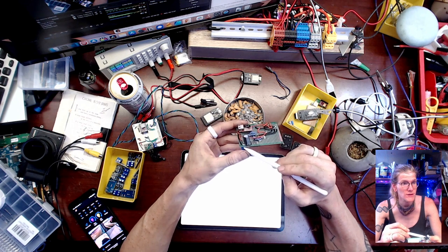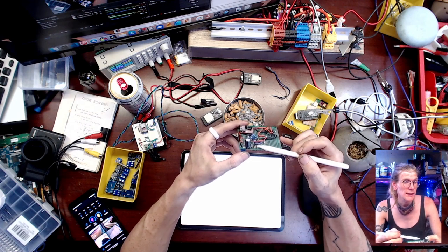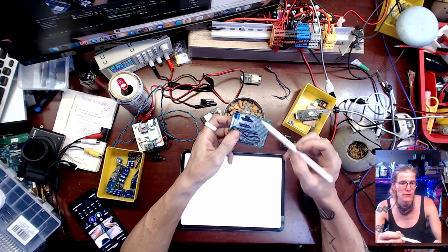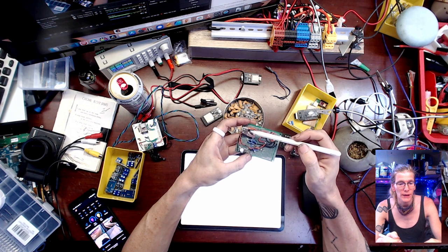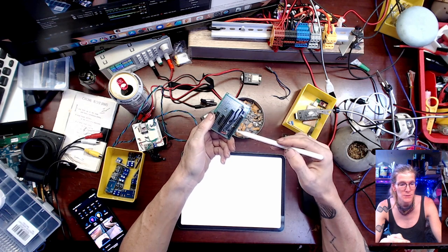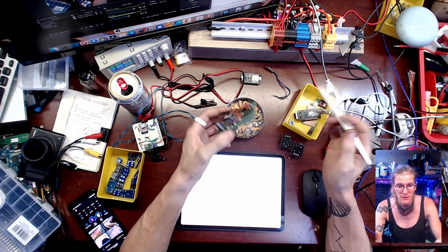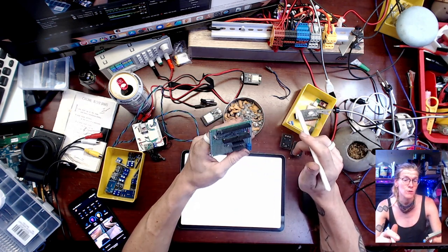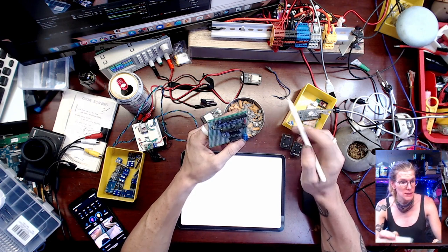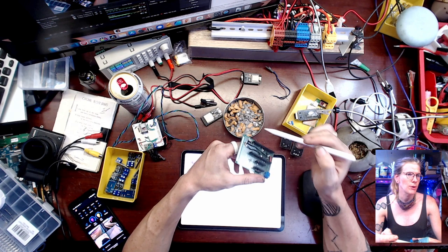Basically, we have the 24 volts in from my main power system, which is anywhere from 21 to 29.4 volts. And that gets directed towards a motor controller, and then also a 5 volt power regulator that then powers the ESP32 and the relays that used to be on here, and so on and so forth. My plan for this was to write some scripts in MicroPython to get all this to work. Also, we have a 3.3 volt AMS1117 for 3.3 volts as well.